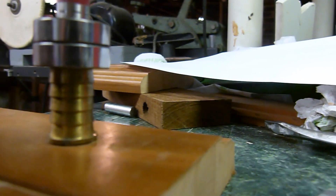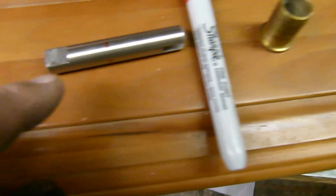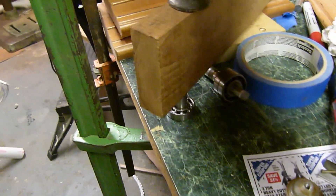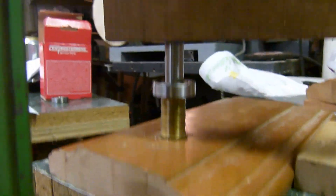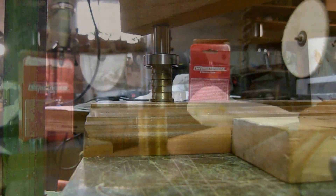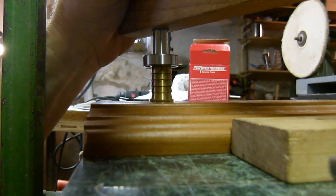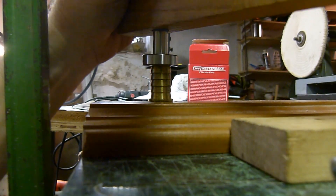We're going to put a mark on the other piece — the other shaft will have some tape on it as a witness mark. I measured the other shaft from there to there, and I put marks on here the same distance. I'm going to cover this with some tape so I don't nick it at all while we're putting it together. So there's the first bearing — we kind of got it pressed in, just partially. Here's the big C-clamp, and there's the bearing sitting in there. The key is to get this lined up on the bottom so that shaft runs right through this tube. We've got it set up, we're going to wind it in — you can see it going down in right there just fine. And we're at the end of the clamp, I've got to reset the clamp.